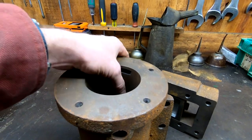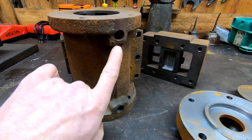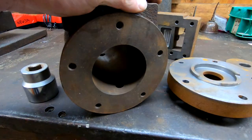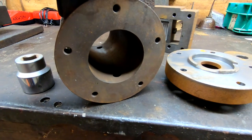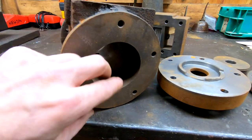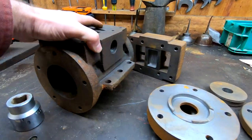Other than that, it's relatively simple. These other ports here are just cylinder drains. This would mount horizontally as it's designed for a locomotive, so that would be on the bottom of the cylinder and allow for draining of any condensation caught in the cylinder before it was preheated, or anything that came through the line while it was being warmed up.